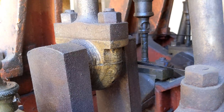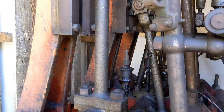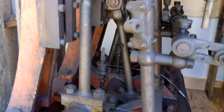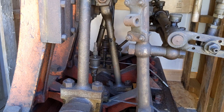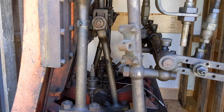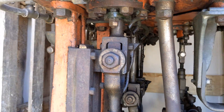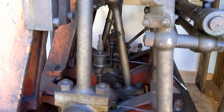I don't know much about the Sullivan Engine Company, but I can tell by looking at this engine they were very aware and conscientious about weight savings and low reciprocating mass. The rods are about the same diameter — a little bit bigger than the rods in some more contemporary steam launch engines with only a four-inch stroke and a lot less horsepower. You can tell the contemporary engines are built a lot heavier than they need to be for their output.